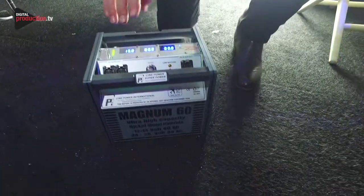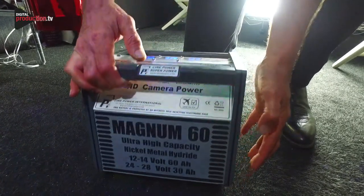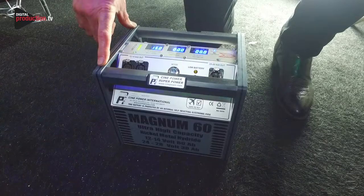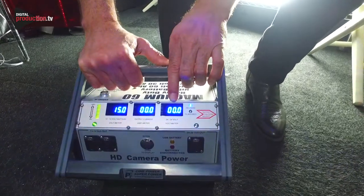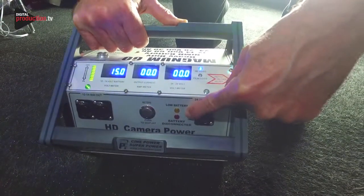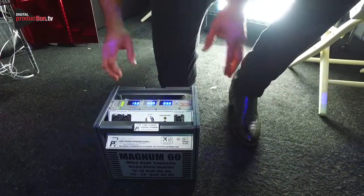This is the Magnum 60 — that's 60 ampere-hour at 12 volts, switchable to 24 to 28 volts at 30 ampere-hour. It is one of the best proven grip batteries we make and is very regularly used by the grip department because of the amount of power they need. It gives you real-time voltage and current to enable the user to see how much power they're using. There is also a low voltage warning light which flashes amber when the battery voltage gets low, and when the red light turns on the power switch cuts off to protect the battery from over-discharge — a very important feature and the reason why the batteries last so well.